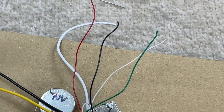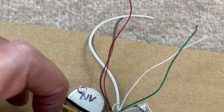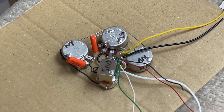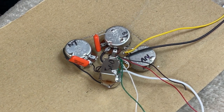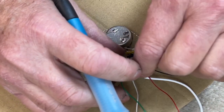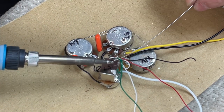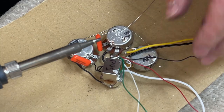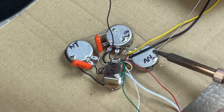There is one thing that comes from the humbucker which we will have to stick right to the top of this, and that is the bare wire. And the same happens in both of these, got to take the bare wire. So, he said, reminding himself more than anything, if I just do a couple more bits on here, I don't want to add an extra dangling wire because there's no real point. So what I think I'll do is, if I imagine the bare wire needs to end up on here, we don't really want it in danger of touching anything. The bare wire needs to ground as soon as possible. That's the problem. And I don't want to bend these too much more. So let's add a bit more on there.